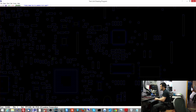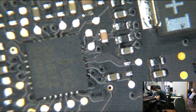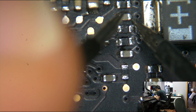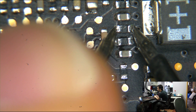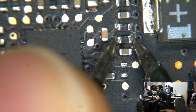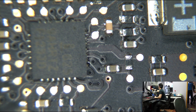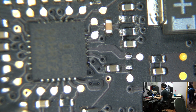Let's see what those look like on my board. They don't look good. One of these resistors is reading 549 kilohms instead of 10 ohms, and the bottom resistor is infinite — open load, open line, whatever you want to call it, OL on a Fluke multimeter. And that's no good.